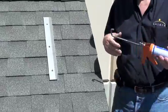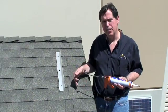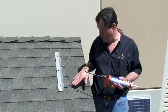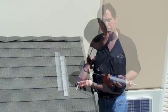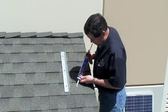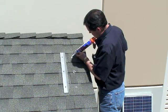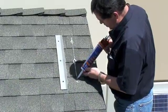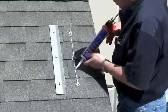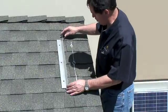I'm going to apply a sealant on the roof and around all of the holes that we're going to drill. The reason for that is when the screw penetrates the roofing material, we want the screw to be bathed in the sealant so that there's no chance of water ever leaking into the roofing material and getting inside of the house. This will also add some additional strength to the bracket and the bracket's attachment to the roof.